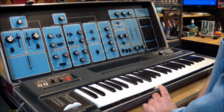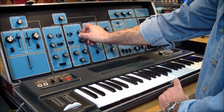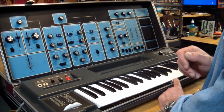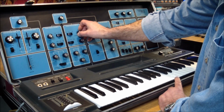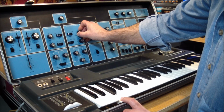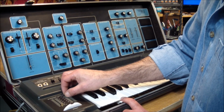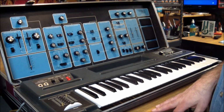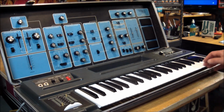Yeah, hear the beat? They're tuned close to each other, but not exactly. So here they're tuned almost exactly, and then you slightly detune them. That speaker isn't very good, but it looks like the loss of the plus 15 volts regulated was what was causing the whole problem. It seems to be working.